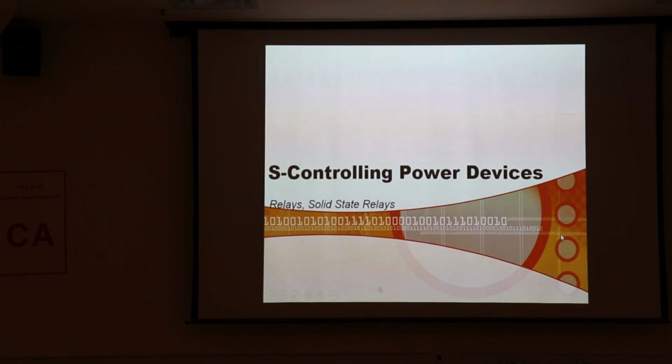It's very easy. All you have to do is use a relay or a solid-state relay. And there are reasons for both, but generally speaking today, it's laziness unless you use an old relay. It amazes me. Most of the time, solid-state relays are just so much more reliable. It is almost criminal to design things today with old-fashioned coil and contact relays. And I'll talk about those a little bit because designing with these is not super easy. It's actually a lot more complicated, and there's a lot of reasons we want to avoid them.